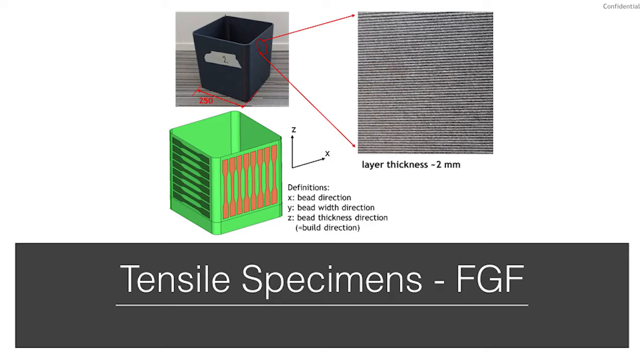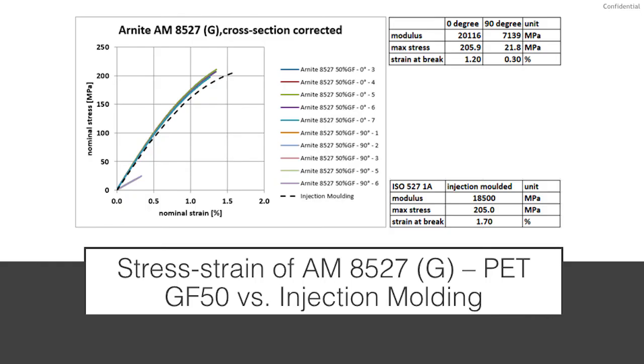Now discussing some of the work that has been done with pellet printing: tensile specimens were prepared by first printing four-sided cubes and then machining tensile specimens using the layout shown in the figure. The layer thickness can vary depending on what the goal of the testing is, and the size of the cube can be altered depending on the number of samples needed. Stress-strain data was generated from bars milled from the X and Z axes. Vastly different results are noted between these two axes, with bars machined in the print direction showing significantly higher maximum stress values. When overlaying stress-strain data of a comparable injection molding grade, a very nice correlation is observed, with slightly higher properties from 3D printed bars most likely due to better overall alignment of fibers in the printed beads.